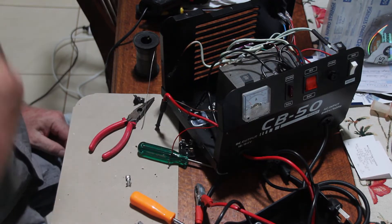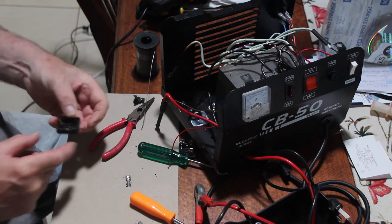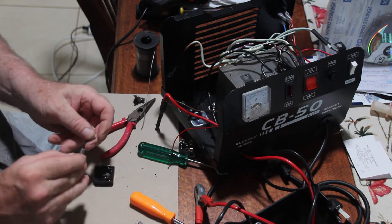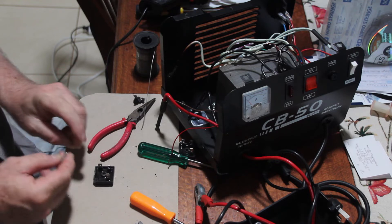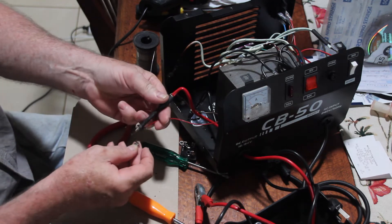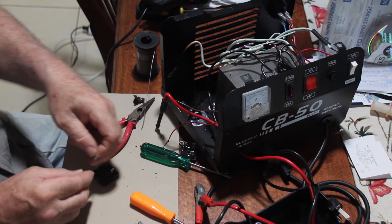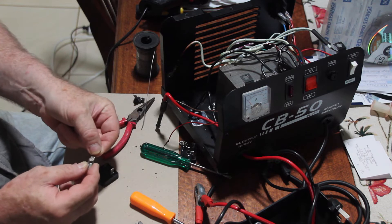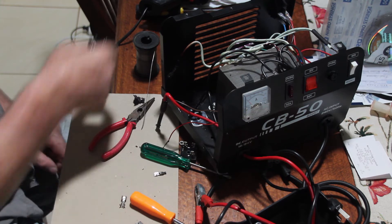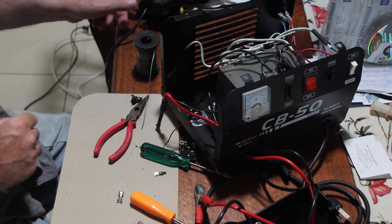There's no denying the Chinese make cheap stuff, but there's a reason it's cheap. Here's the broken one I took out. It broke off just trying to pull the connector off of it, and the reason it broke off was these wires have been soldered in — fair enough — but when they soldered it they must have clipped on, because this was soldered to the pin and the heat stress from soldering that to the pin may have been what caused this to fail in the first place. Really, really poor quality control.